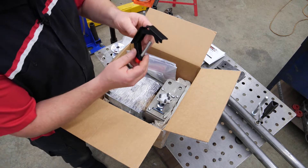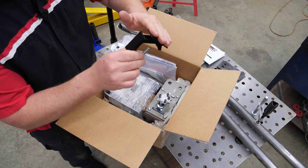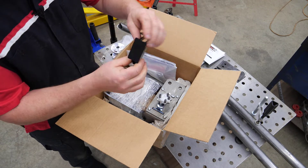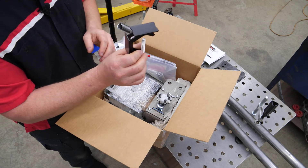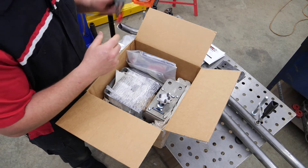This is a block holder. You put this on your tube and lock it down, and you can put your indicator block on there so you know the position of the tube. So when you're going corners, you can make sure you always have it at a perfect zero or 90 degrees on the tube.